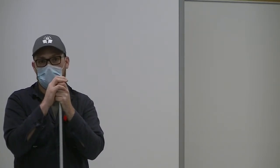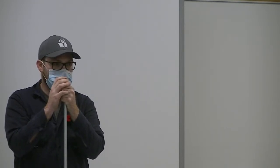It's a cleaner install. It also mechanically protects the wire from incidents — from being hit with anything. You might have rodents that like to chew on insulation, or drywallers that like to put screws through it. A drywaller will find out pretty quick when they hit a piece of metal compared to just the wire.